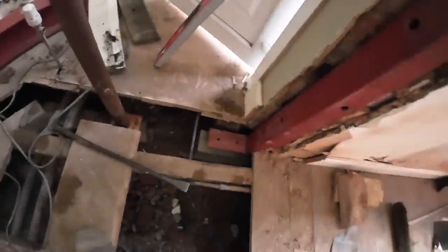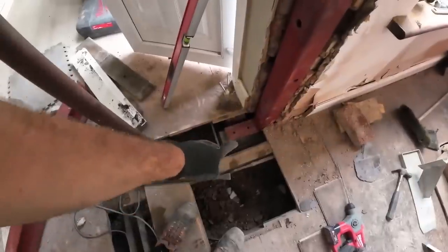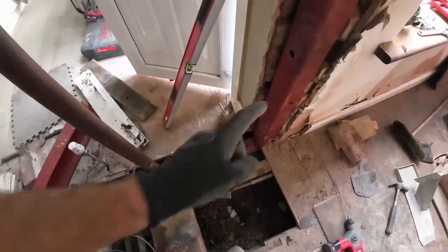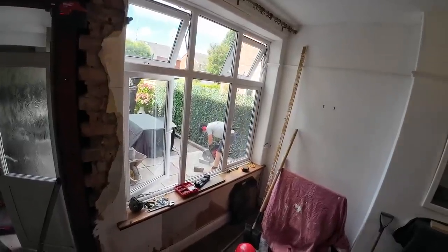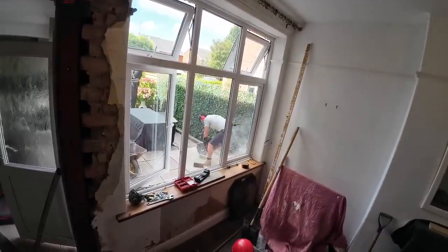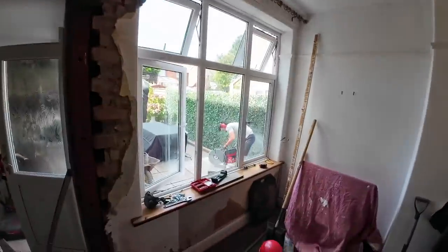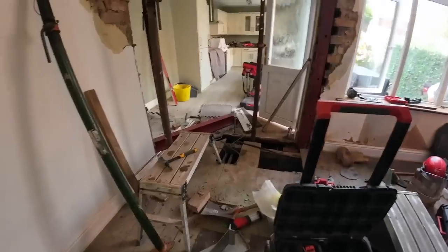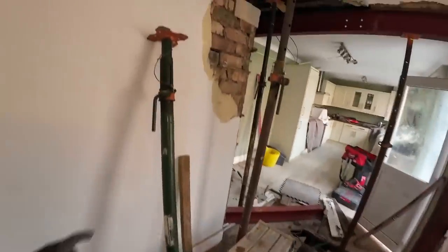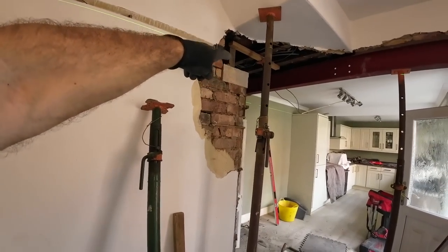Yeah, so I've got my pad stone in position temporarily. So I'm going to mark my holes, I'm going to drill them and put it back. Alex is going to get this pad stone into position before dinner, so it's going off.